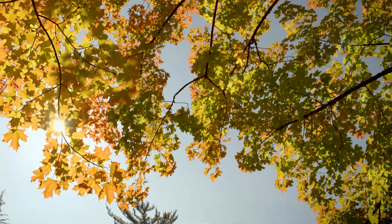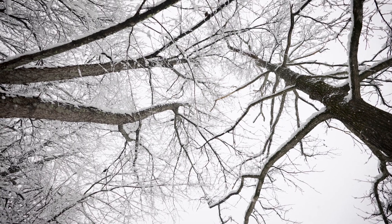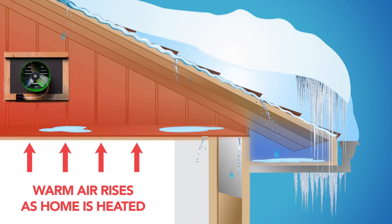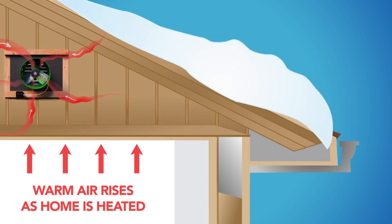And in very cold climates, the temperature settings can be lowered to cool and ventilate the attic to prevent ice damming. Warm temperatures in the home and cool temperatures in the attic can cause ice buildup on the roof in snowy climates. Smart Mode gives the ability to change the preset very easily to ventilate the attic and help mitigate ice buildup.